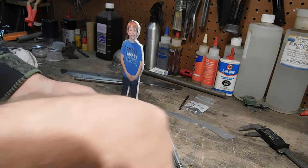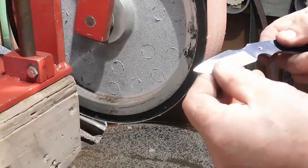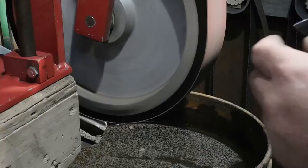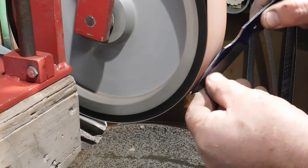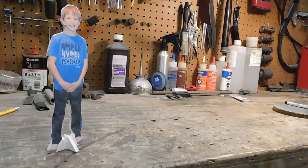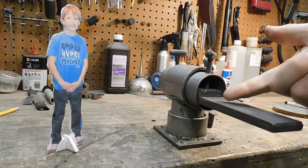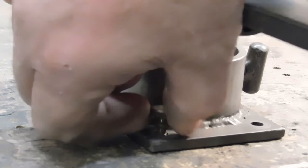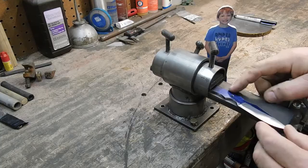There's a pre-heat-treat ground up to 220 — not too bad. I think it needs a little bit of a top swage. I usually do a little bit of hand work on mine, because we all know how fun hand sanding is. Alright Alex, to start the hand finishing process you gotta have a vice. I've got some threaded inserts in my bench so I can get this thing out of my way when I don't need it. So we'll mount our knife in there and with sandpaper and various different shaped objects we'll clean this thing up a little bit.